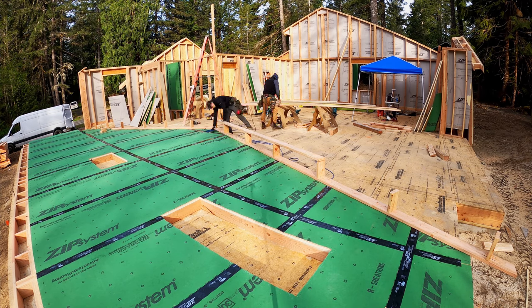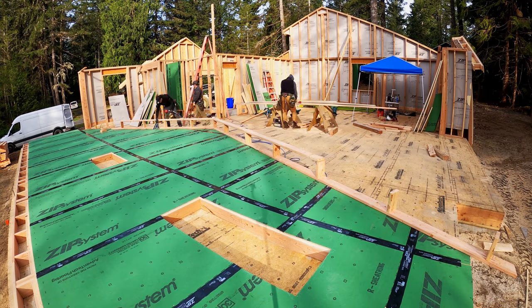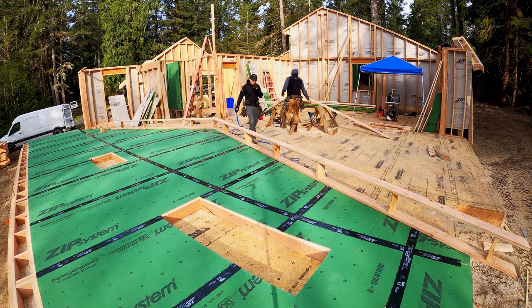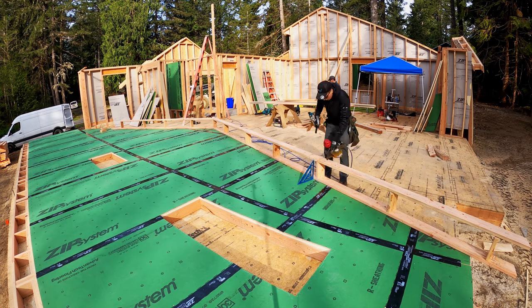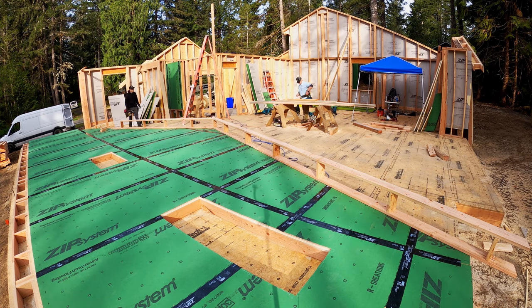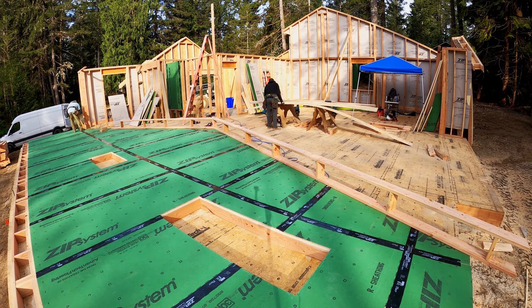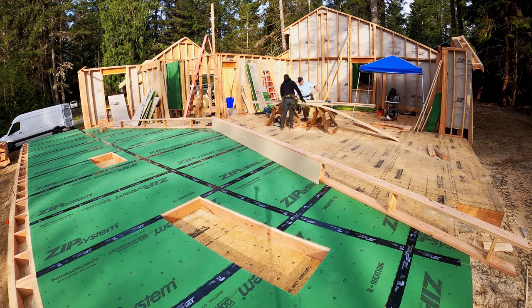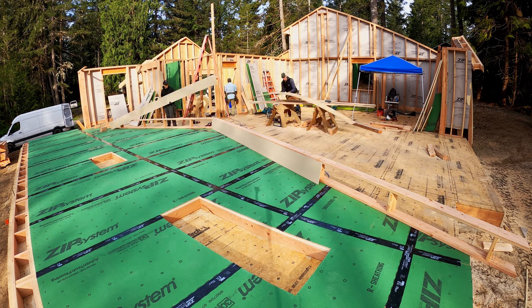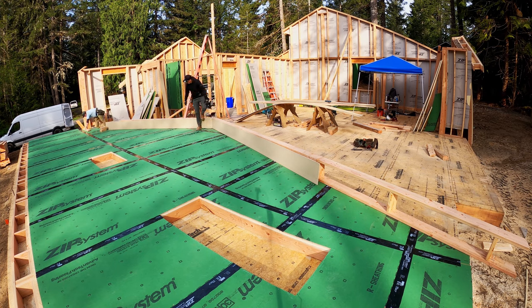Once all of that's done and the wall is sided, then we brace those square to the wall. Those braces stay in until the roof is sheeted and generally until we get back up on the wall to side if we need to side. Otherwise, we just get on a ladder, pop up there and pull them off. After we've sheeted, after the roofers have been up there, and those overhangs are rock solid. In our climate zone, we use 16 foot lengths of the, I think it's 3/8, or maybe it's 7/16, I think it's 3/8 by 16 foot LP soffit.